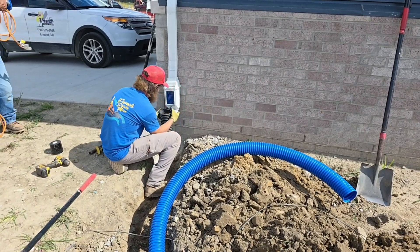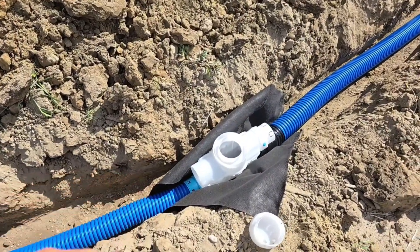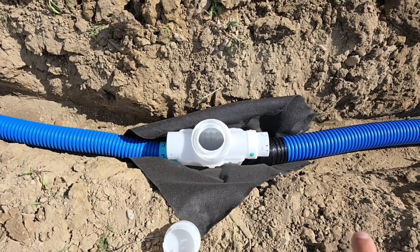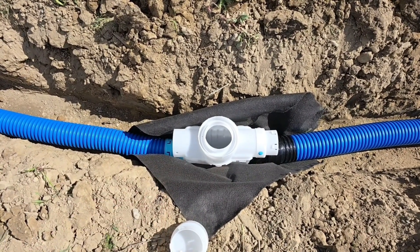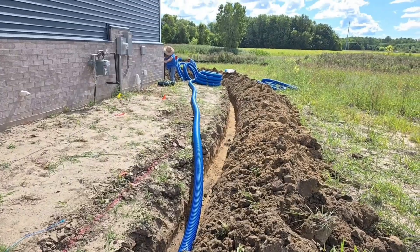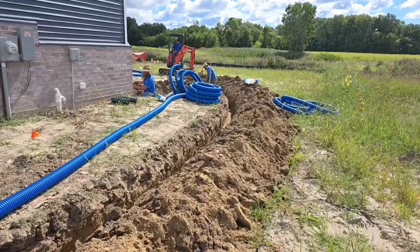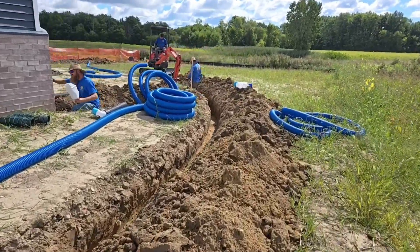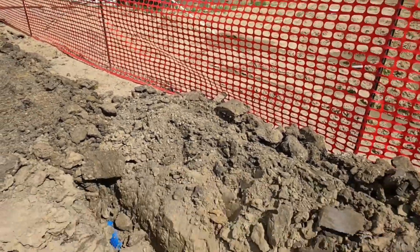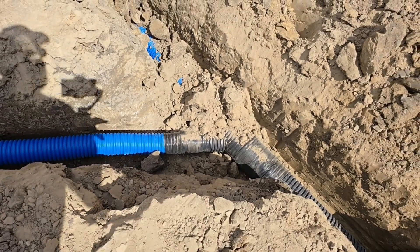The guys are starting the second main. They have a three-and-a-half-inch line coming off this downspout going into the bottom — when you start out your system, that first three-and-a-half-inch downspout acts as the main. Start at the bottom of the four-way connect, then bump it up to four-inch. They have a beautiful trench — and we are deep, because there's going to be an irrigation system put in. We don't want the pipe puller catching our drain pipe, so we install before they do.